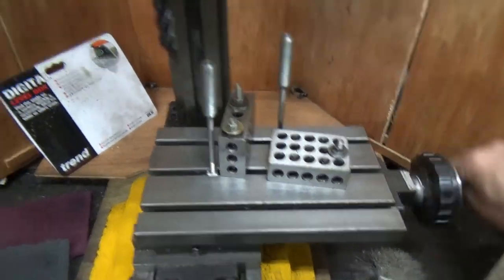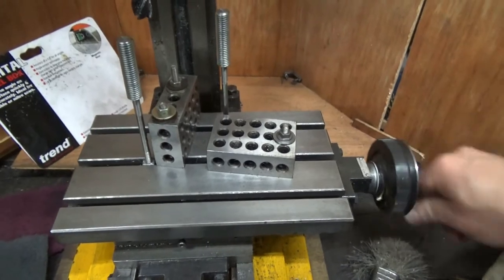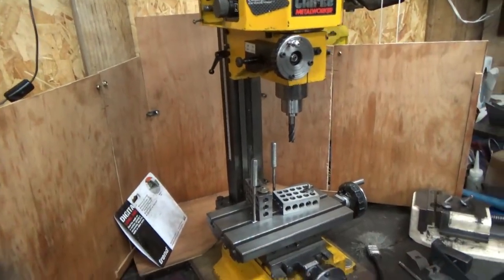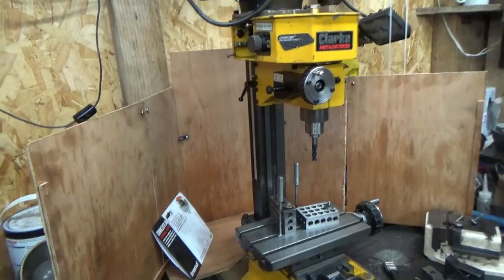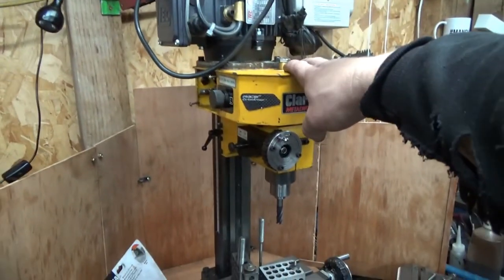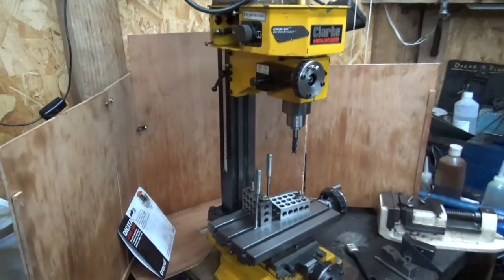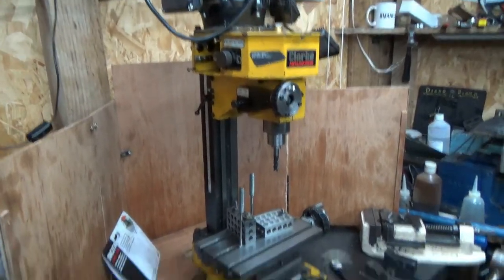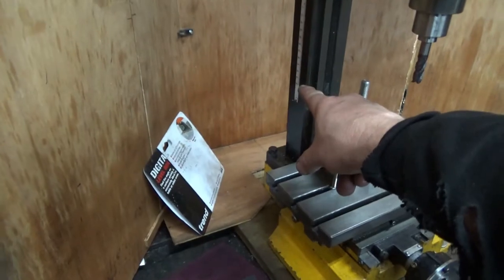And then also, it's a bit light. So that base is 30 kilograms, which is about 60 pounds, the new base. This whole machine is 42 kilograms with the original motor on it. So that whole new base is nearly as heavy as this whole machine. And the top end is not a light thing to pick up on its own without the motor on. I should imagine we're going to go from 42 kilograms up to around about, I don't know, 60 kilograms. So it's going to double its weight, adding some mass, and I'm going to get some extra Z height.